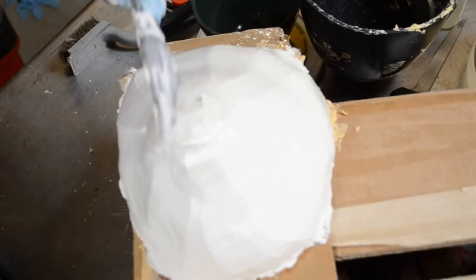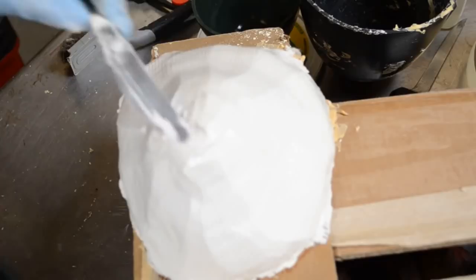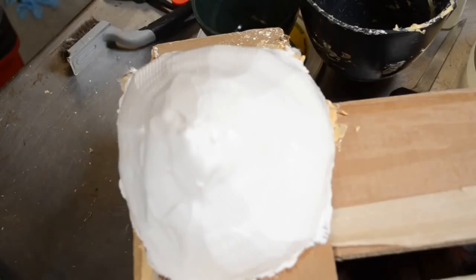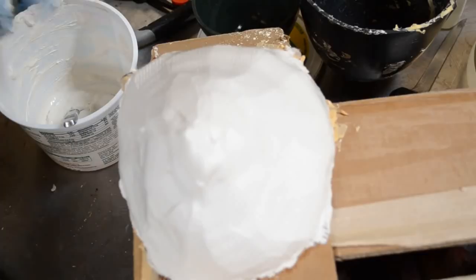Now, if you're looking to make a death mold from silicone and you want a good solid product for a mother mold, you can use HydroCal. You could use number one molding plaster and reinforce it with either cheesecloth or burlap, or you could use a product called Durham's Rock Hard Water Putty, and that works exceptionally well.